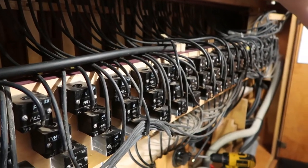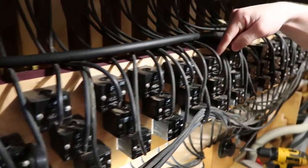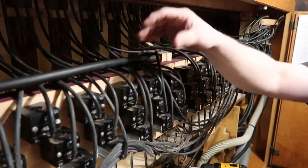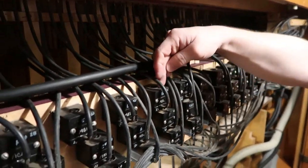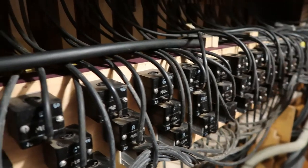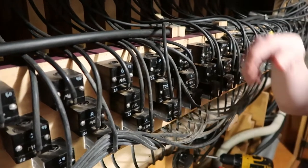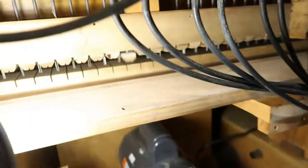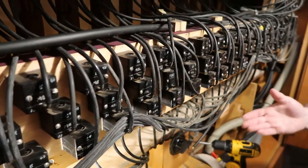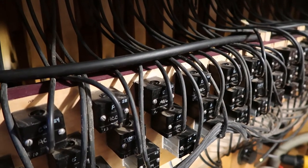When the paper hole opens, it releases vacuum, letting the vacuum escape to atmosphere. This valve opens, and it triggers a much larger valve inside that does the real work. And that valve either plays the percussions or it collapses a pneumatic up here, which pushes down the valve for the pipes, which is pressurized air instead of vacuum. So that's how it can do something even without air pressure, because we had vacuum pressure. That's so cool.